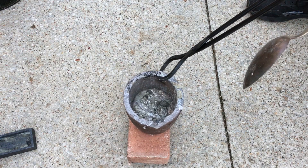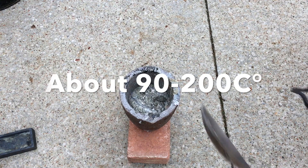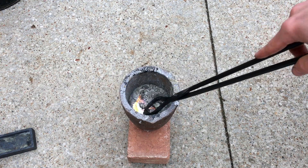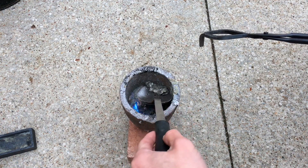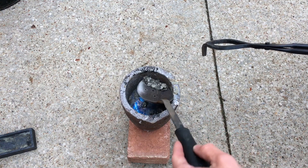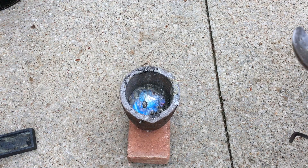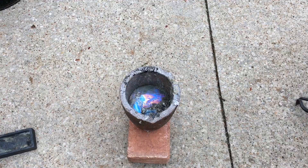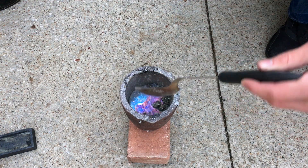That is where the process of artificial aging comes in. To artificially age a piece, it must be placed at an elevated temperature — about 200 to 400 degrees F — for roughly 24 hours. The specifics for each alloy can be found online, because not many people have an L&L Special ADC-813 dual chamber aluminum heat treatment furnace chilling at home. A stainless steel General Electric JB-645 induction oven will suffice for the purpose of heat-treating the metal.